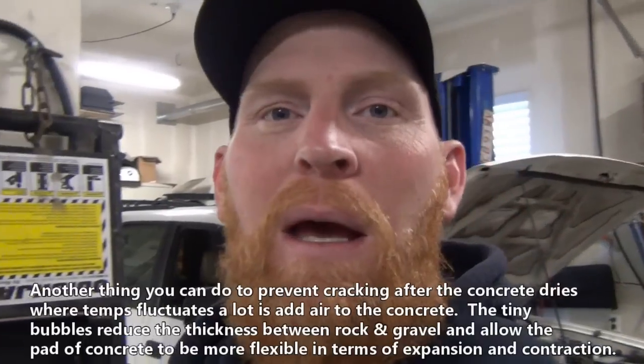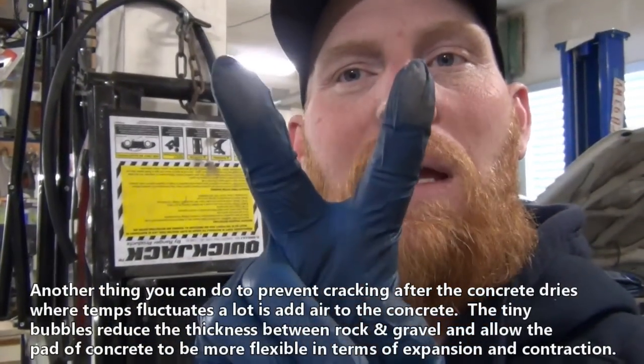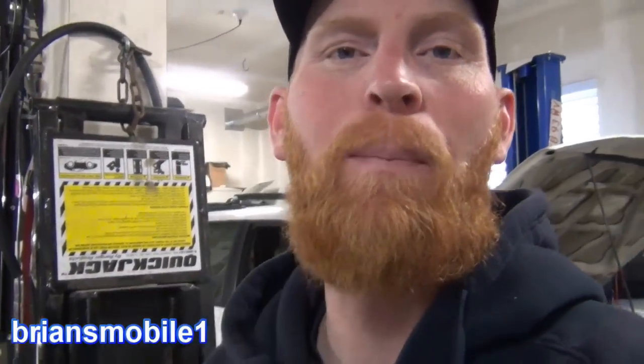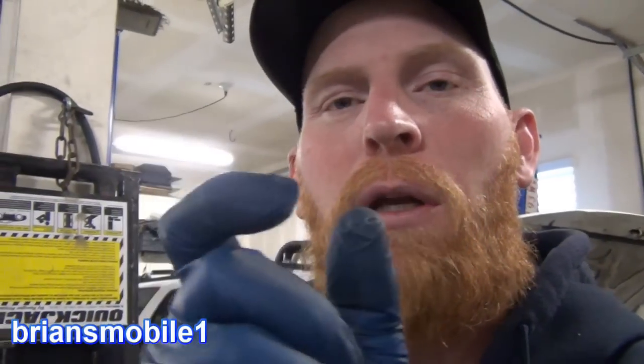The nice thing about the big control joints with big edges — the reason they do these in a lot of places — is that inside it shouldn't freeze, but basically they make it so that the ice pushes up and has an escape route. It's shaped like a V so it has somewhere to go at the top. You can fill it with stretchy stuff — polyurethane — and then it can flex and move. The concrete can expand and contract without letting water in, and prevent frost wedging, which is like driving a splitting wedge into wood.